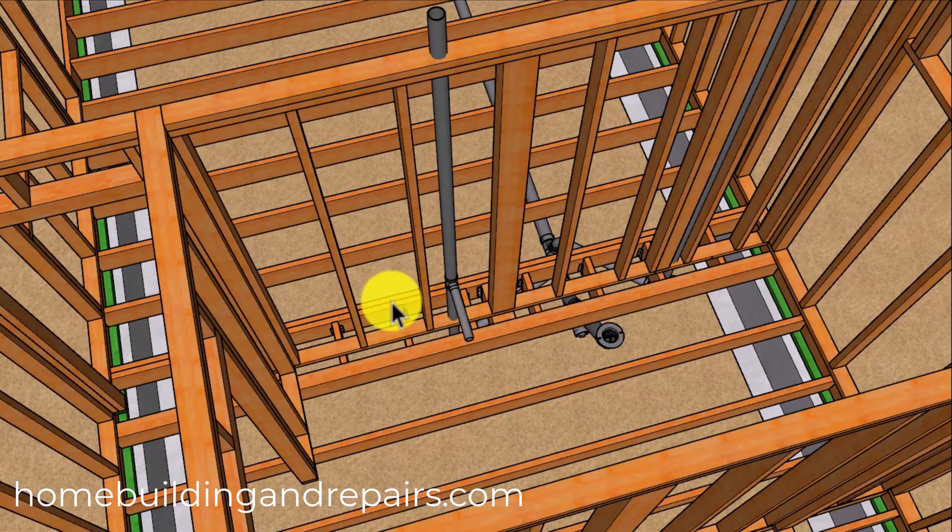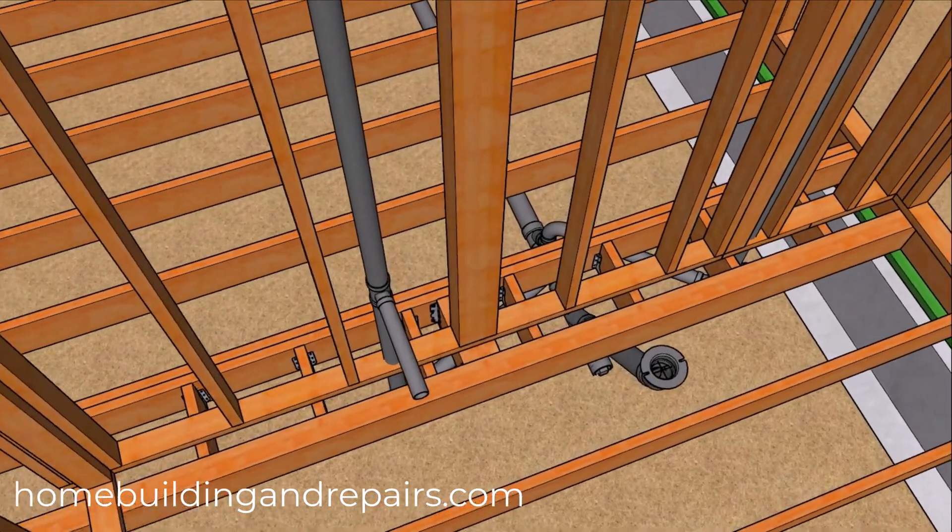And if you have the room, you might need to install a wider joist. For example, if you have a 2x6, you might need a 2x8 or even a 4x8 or a 6x8. These boards might be extremely difficult to get in with all the plumbing or whatever is in the way. And let's not forget that I'm not a structural engineer — you might need to contact one for an approved repair suggestion. So you're welcome, engineers out there, if this is something you haven't thought of.